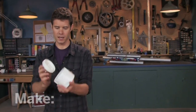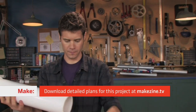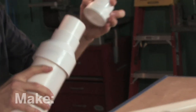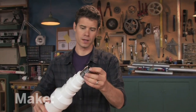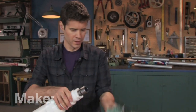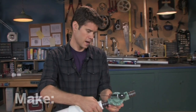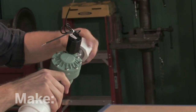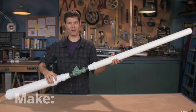I've got a cap for the end and a threaded adapter. I'll screw that in and place this onto the air pipe. I've got a reducer to bring this down to the size of the valve, a little extra pipe there, another reducer, and a threaded adapter that will allow me to screw on a pipe nipple. It's important to do this dry fitting before you glue everything together so you know it's going to work. Here is the solenoid valve — let's screw this on. Now I've got another pipe nipple, a threaded adapter, and finally the last reducer to bring me to the diameter of my barrel. Okay, it's all put together — now let's glue it.